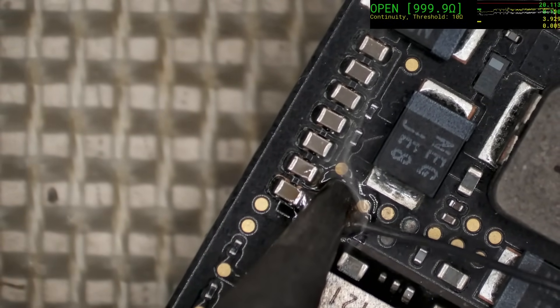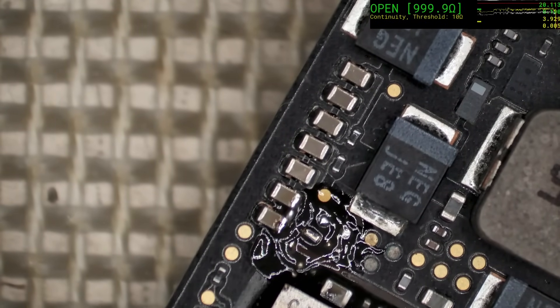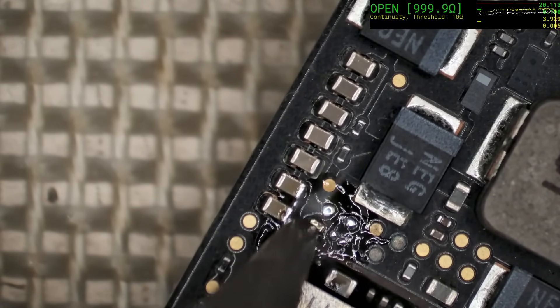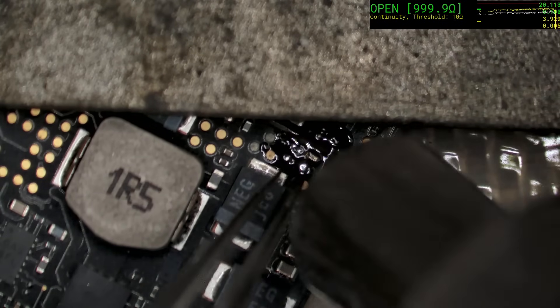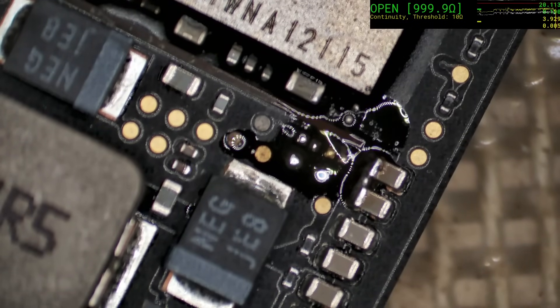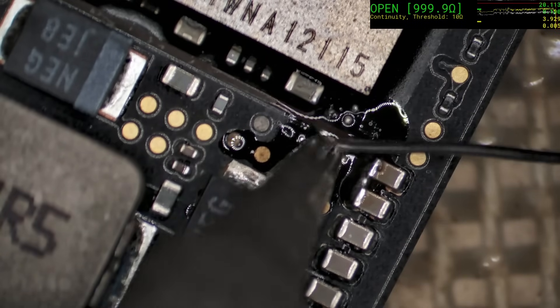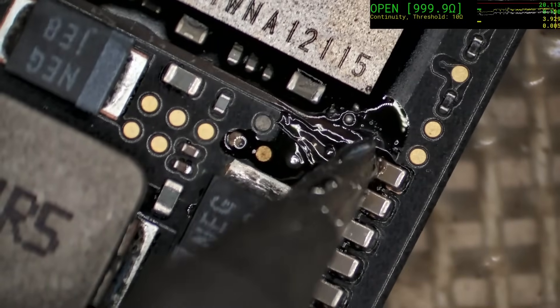Naturally it's persisting — that does not want to come off. Well, it certainly gives me confidence in the security of the pads, but unfortunately now I've probably damaged it, so it most certainly has to come off. I'm not worried about those bridging — we'll fix that in a second. Fortunately there does not appear to be too much thermal mass on those particular pads, which makes sense because they're not power lines, they're just signals. So we'll clean up this mess that we created.